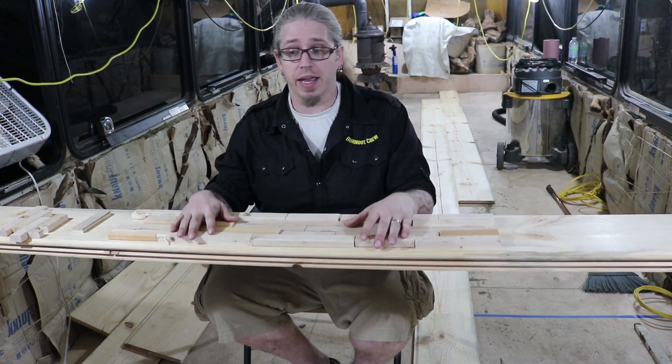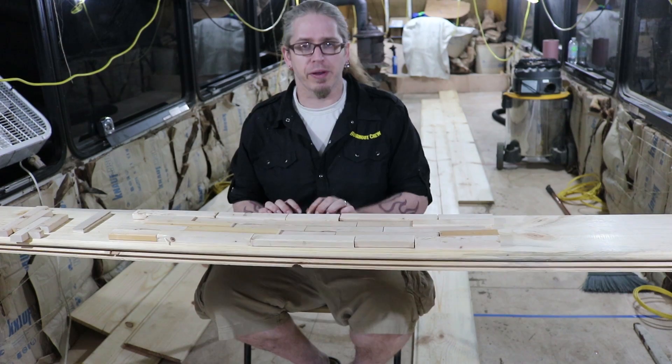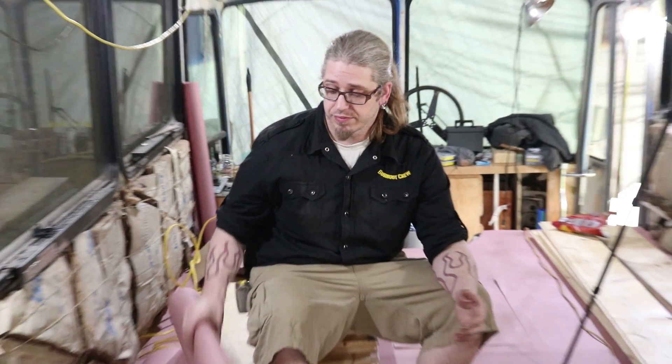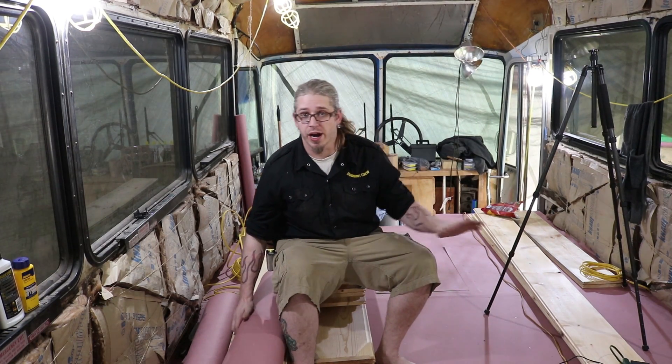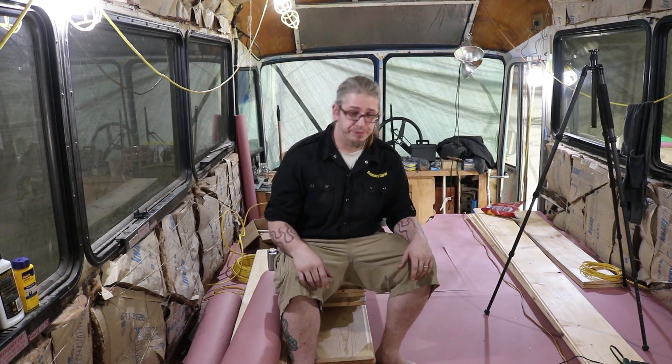Now that we've got it all laid out and the pieces cut in five, seven, and nine-foot lengths outside, we need to bring those in and mark out where the hatch templates will go. But before we actually start attaching the flooring to the bus, we need to create a slip layer so it doesn't squeak and allows for expansion without bowing the wood. We're using standard red rosin paper — easy install, just stapling it down with a six-inch overlap. Buy it at your local home center.